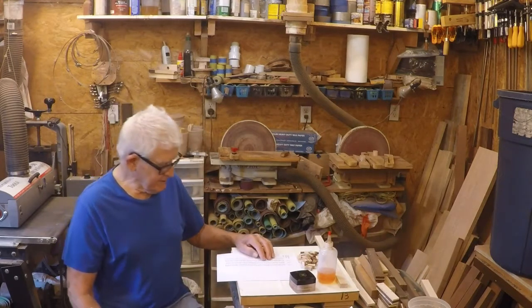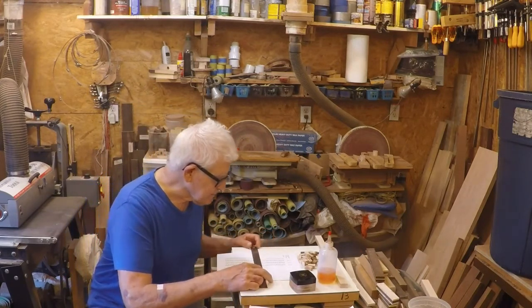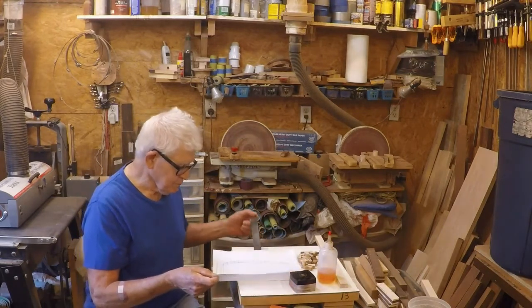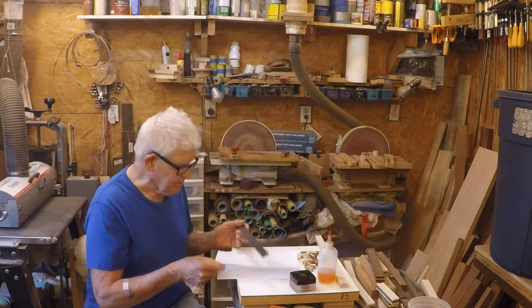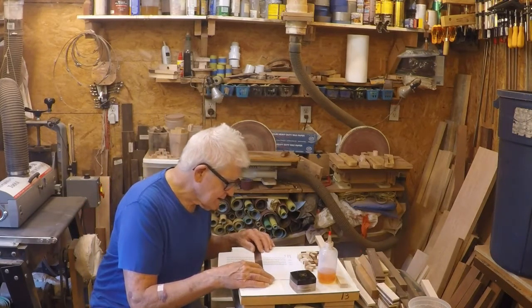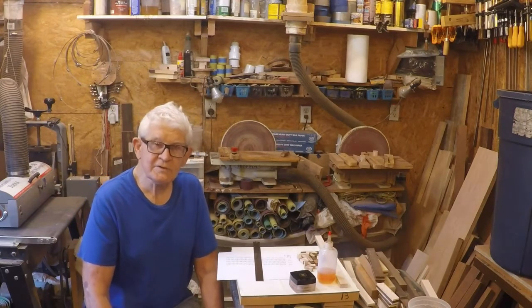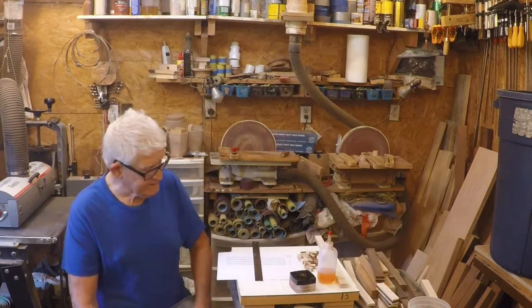So I'm going to use this new revised one and cut 24 more segments today and see how they turn out. Like I said, let me see here. I believe I was looking for 7.5 inch. Yes, this is 7.5 inch I want, and it's 24 open segments at 7.5 inch. The new number I come up with now is 0.6912. So I'm going to cut segments to 0.6912 and we're going to see how that works out. And I have more confidence this time. I hope it comes out right. We'll see.